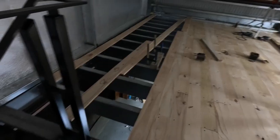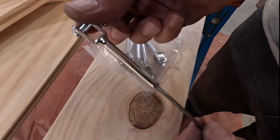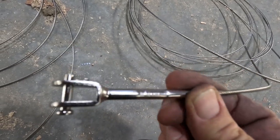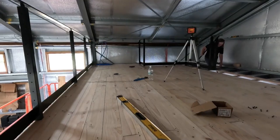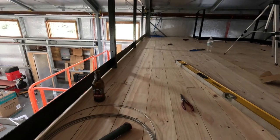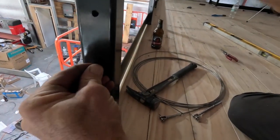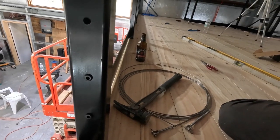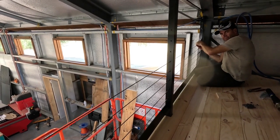I'm really happy with the way this floor is coming up. At about three quarters done I start with the balustrade wires. The wire pushes into these end fittings on both ends and you use a hydraulic crimping tool — it crimps down really tight on that cable and it's not going anywhere. There are eye bolts screwed into the end post on both ends. I bought some rubber grommets that fit in the centre holes — you just need an 8mm hole and they clip in real nice. Feed the cables through, then once through I crimped the other end on. This is the adjustable end with the tension screw on there, and it's quite easy.